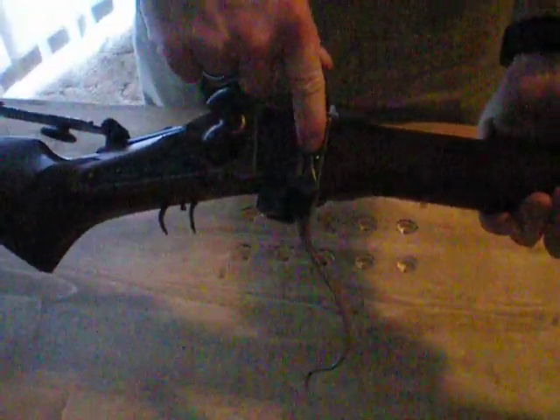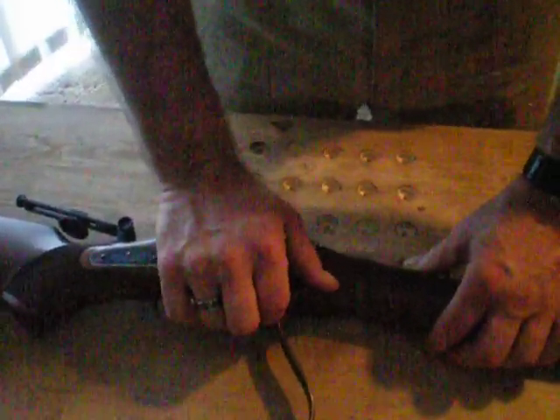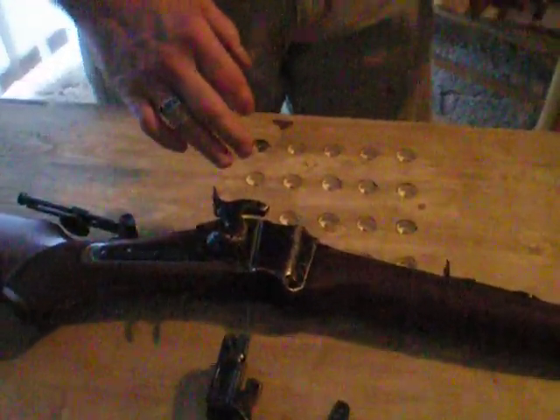Now there's a through pin on the frame here, held in place by a spring-loaded plunger. To remove that pin, you compress that plunger and pivot the pin lever down — it just takes a pull. The block and extractor come out after that.